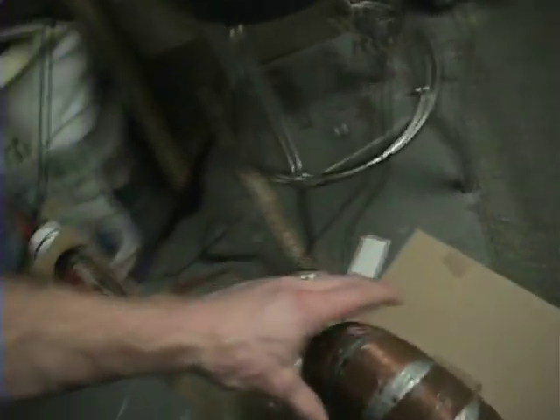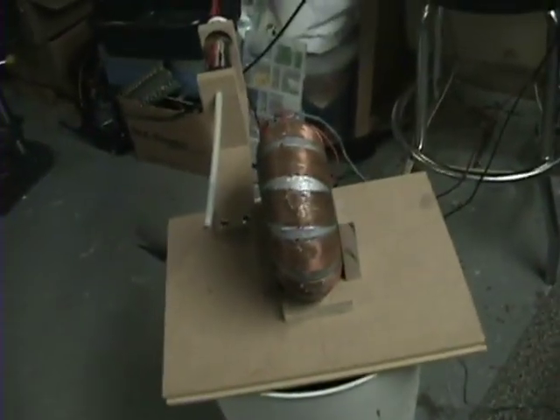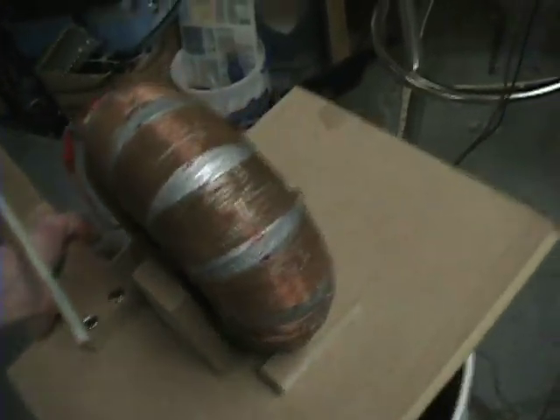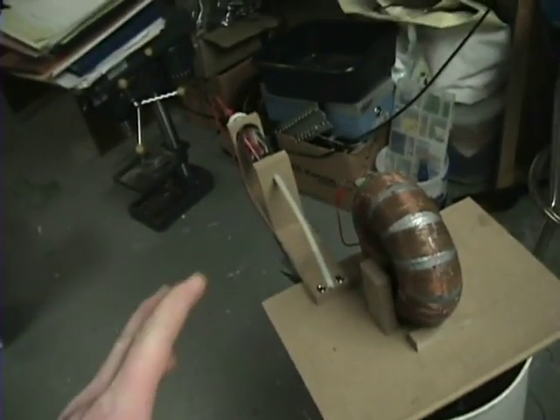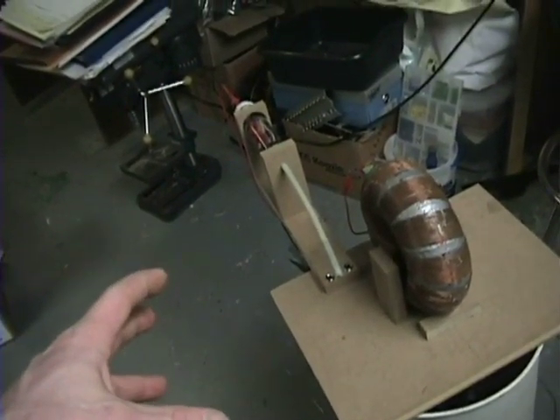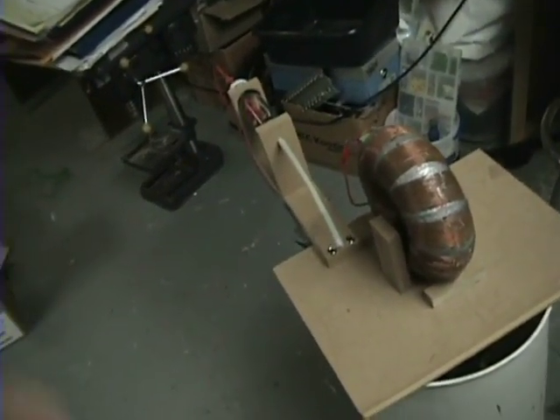One of the dilemmas I had personally on this is orientation of the coil. I've got it sitting vertical and what I'll be doing is turning this whole jig around so that I can align the coil up differently with the magnetic poles of the earth. I truly do find that will affect this test, or at least if you were doing measurements to the T. I do believe that would change the results — I honestly think orientation of the coil is a big deal.